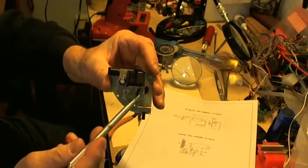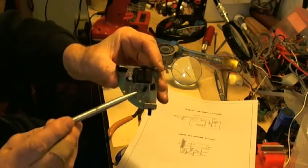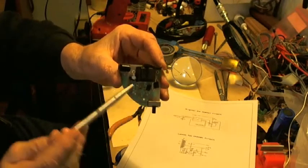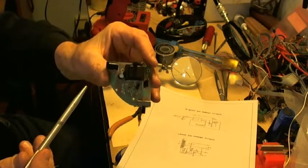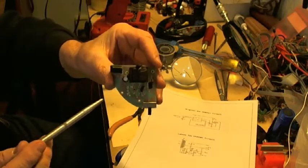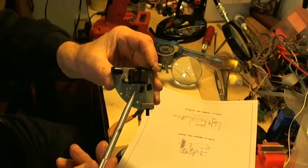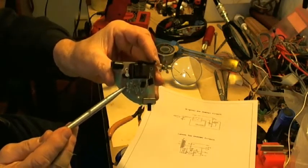And for the second transistor, which represents the second trigger, there were three components, including the transistor. It does not have to be the same transistor you use for the primary. It can be a simple switching transistor, like I said, a 2N2222 from Radio Shack, or a 2N3904. And of course it had its diode protection and another 1.2K resistor connected to the base.